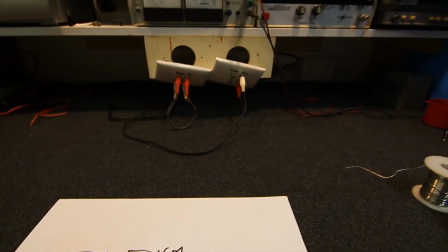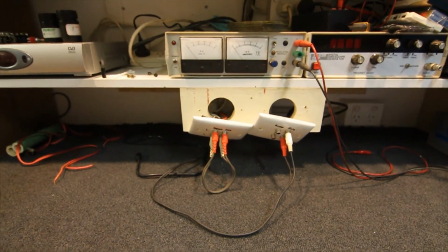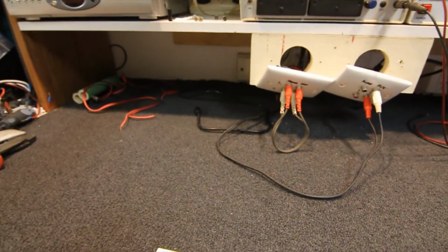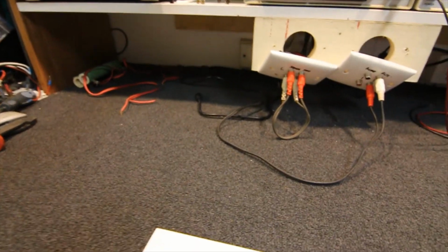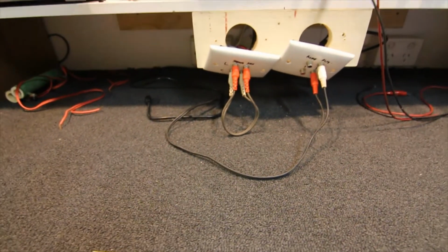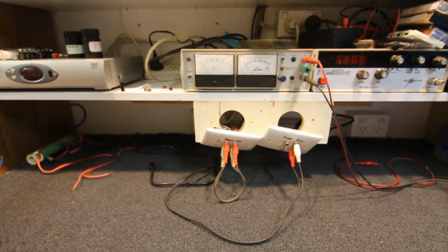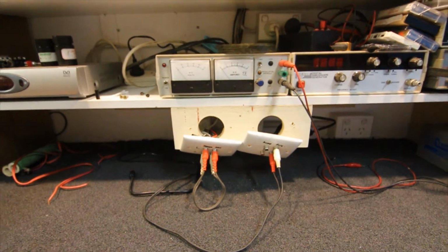But if you've got an earth leakage breaker, which you should have these days, there's no excuse, because they're so cheap to buy now, to have some sort of earth leakage protection in case you touch something, especially audio gear. There's often transformers, switches and stuff that have no insulation on the terminals, so it's easy when you're working on a tape deck or something to have your hands messing around with the mechanism, and next minute your finger's gone back a bit and touched something with 240 volts on it. Even though you should have it turned off, you don't always, because you're trying to check something out while the unit's running. So always best to have earth leakage protection for your bench. You'll probably only ever trigger it by accident, by, like I say, touching the neutral or something, but at least it's there should you ever get in a dangerous situation. But that's basically my bench.